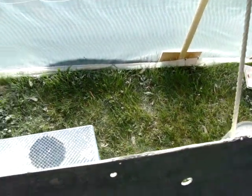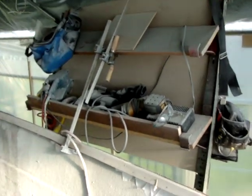So the next step is, like I said, putting the transom in. I have to feather the back edge of this so that when I finish the whole thing off, everything will blend in, and then once I build this out 2 inches, I can start putting in my stringers, and then build the boxes back here for the battery boxes, fuel, live well, things of that nature. So that's so far so good.